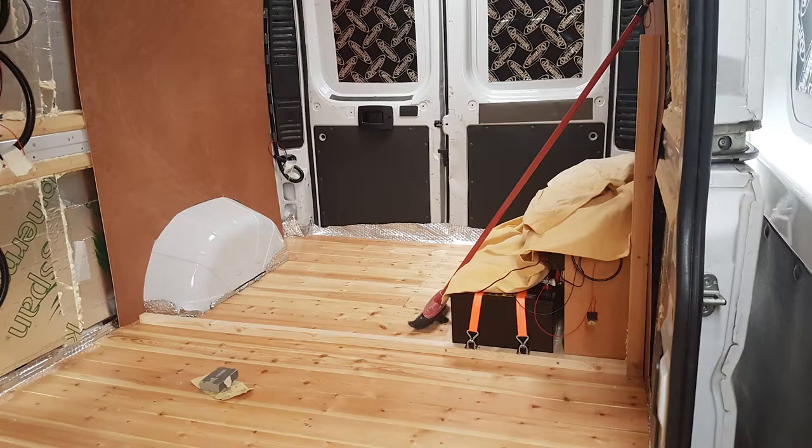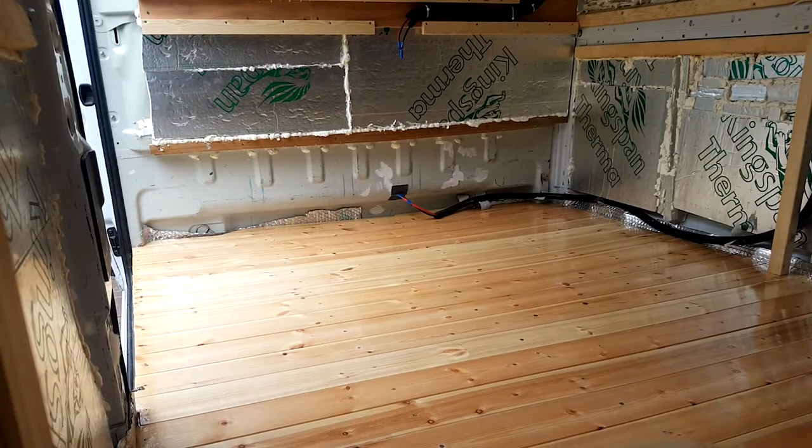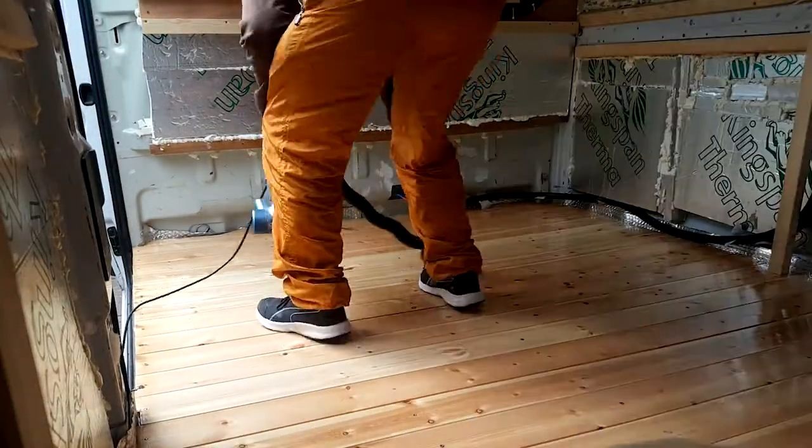The first step was basically just to tidy everything away — there was a lot of clutter in the van. Being organised and tidy is definitely a good idea. Having discrete steps where you can get everything out and just bring in what you need for the next stage is definitely helpful. So we cleaned everything out, did some brushing, vacuuming, then sanded everything with a fine grit sandpaper, vacuumed that up, and then wiped everything down with a little bit of white spirit. In retrospect this wasn't the right thing to do, because the varnish instructions say to clean it only with sugar soap. For subsequent coats I just wiped it down with a damp cloth, and I think that's perfectly adequate.